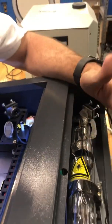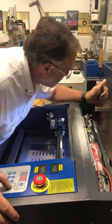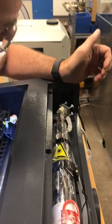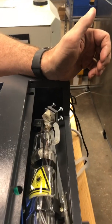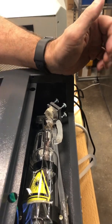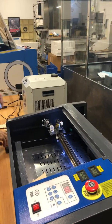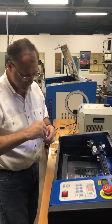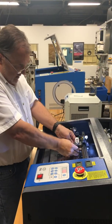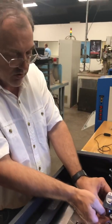Let's see if the tube was aligned. Let's hope the tube was good, because I hate having to move the tube. I'm at 9% power — let's get a little short shot. It's close, it's a little bit off, just off to the side there. What I'm going to try to do, because I don't want to move the tube, is move my red dot over to that CO2 dot. I want the two dots — the CO2 dot and my red dot — to be in the same spot.